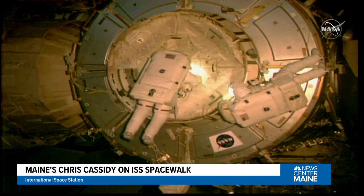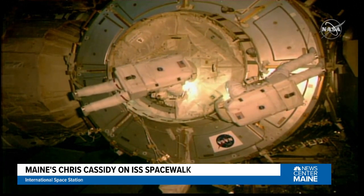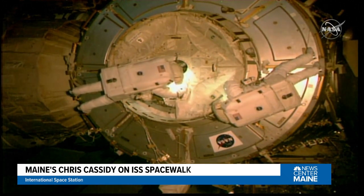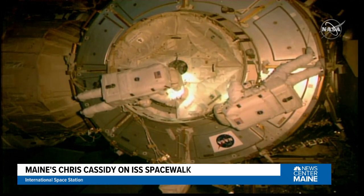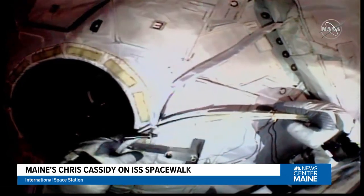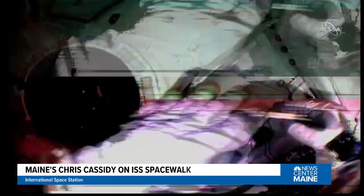Looks good, Bob. At this point, looking to capture all three of those 1449 cable legs into your one long wire tie and gently pull it back to the edge of the CBCS opening, back strongly enough so that it doesn't get in the way and weakly enough so that we don't deform, kind of right in the middle. Okay.